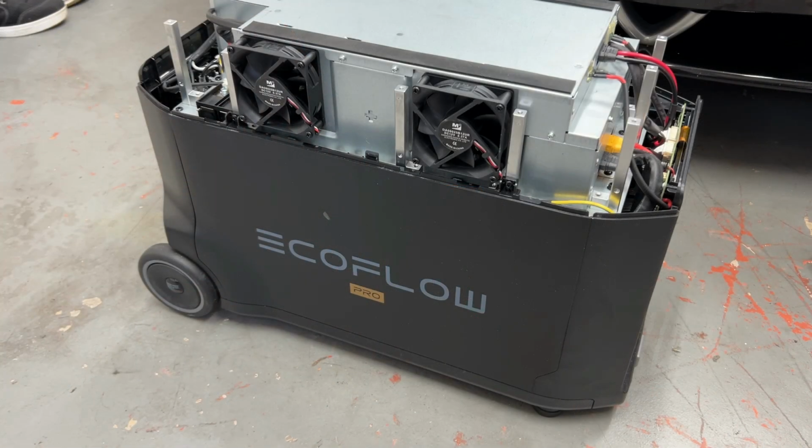Well, unfortunately, now we know we have to do a little bit deeper surgery on this thing to correct our problem. We will have to remove the side panels and then take that rear panel off. Mostly, I'm having to take the rear panel off because I want to find that loose screw. So to get the side panels off, it's pretty easy. You remove this screw, and the other side is very similar, and then that panel will lift up and out, straight up.